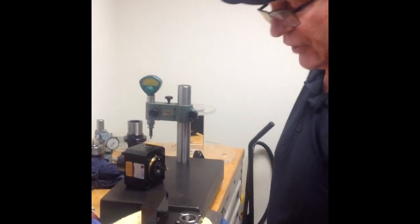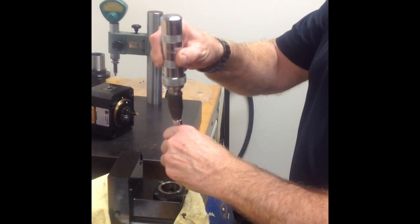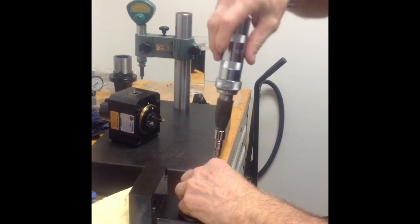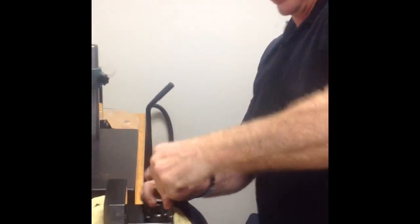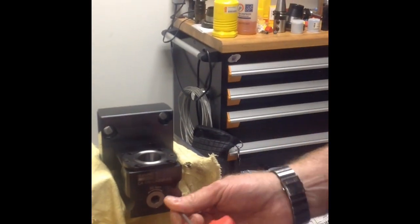It's very helpful to secure your clamping unit in a vise and I'm going to start by removing some of these screws. This one seems awfully tight so that's maybe where the impact driver will come in handy. For this size I need a couple of little adapters — I'm going to use a Torx Plus bit and give it a smack. The rest of them were pretty loose so we're just going to remove these four screws, and then I'm going to take out the screw for the cam shaft retainer. Five screws total.